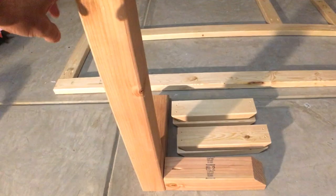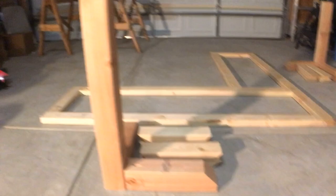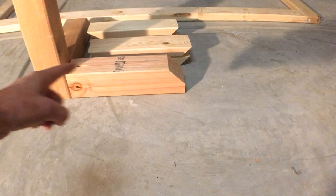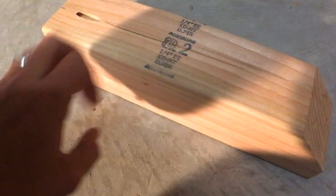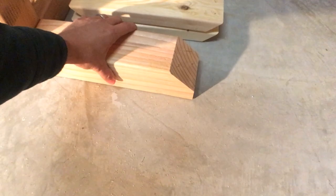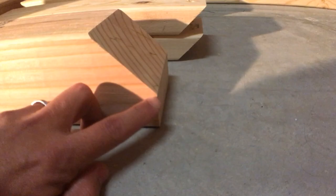You're going to need three legs — this leg right here is 28 inches tall, so you're going to need three 28-inch 4x4s. The next thing we have are the leg pieces. These are 14 inches across. You can expand that out to 16 inches if you want to give it a little bit more, but I thought 14 inches were going to be fine. I already did the pocket holes on each one on all four sides, so you're going to need six of those. And just for decorative purposes, we took off a 45-degree angle notch for the leg.